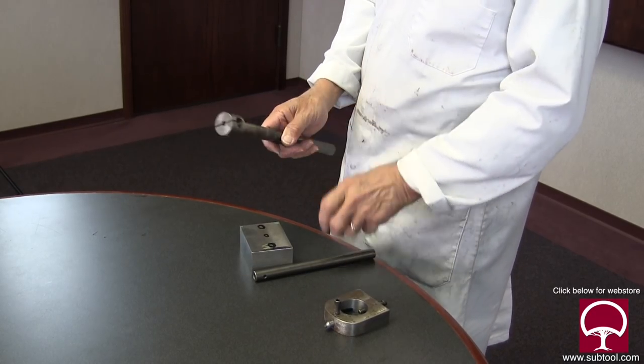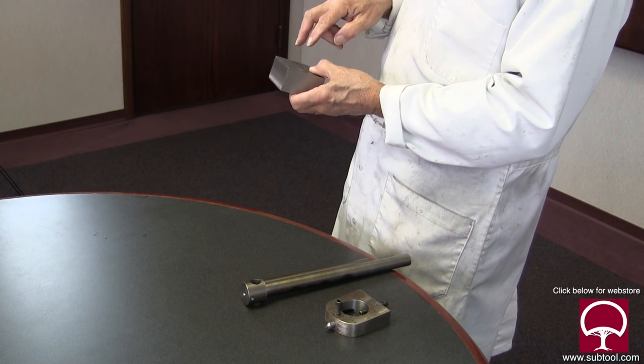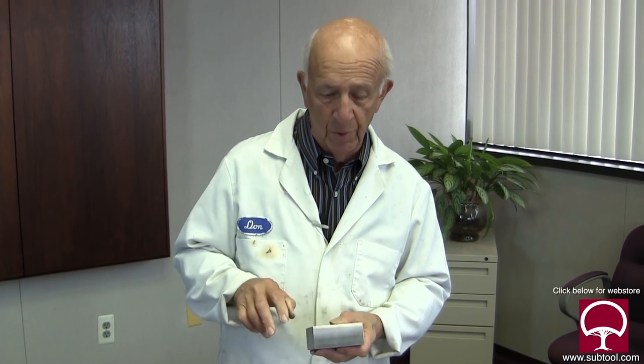You've seen the problem and now we're going to show you the solution. These parts have already been machined and they need to be ground — we're going to grind them to within a thousandth or so for a nice slip fit. We're going to machine this block as well: put a hole in the end with cap screws to lock it down, drill a couple of holes to mount it to the tailstock, and drill and thread for quarter-20 cap screws so we can screw this into the tailstock.